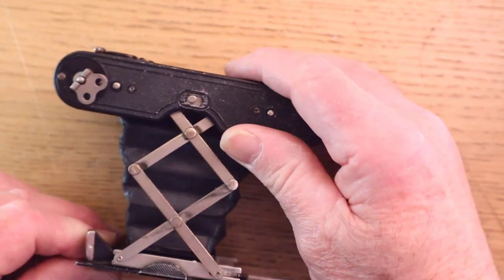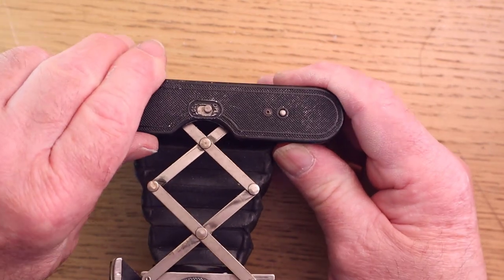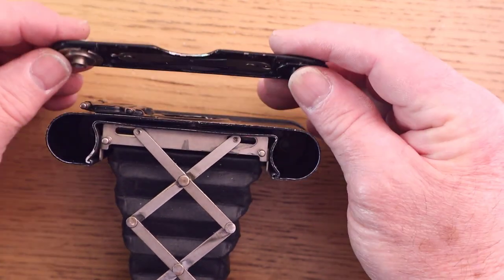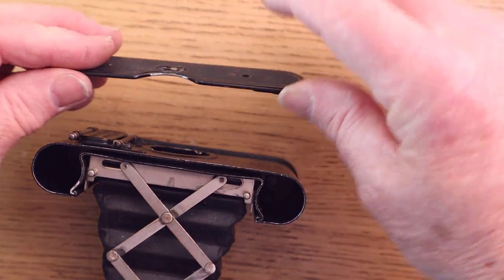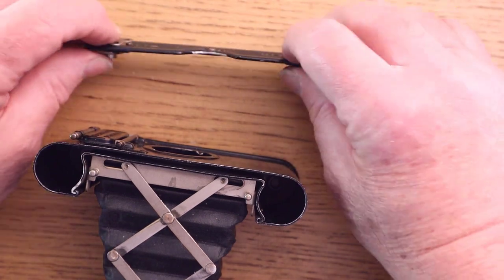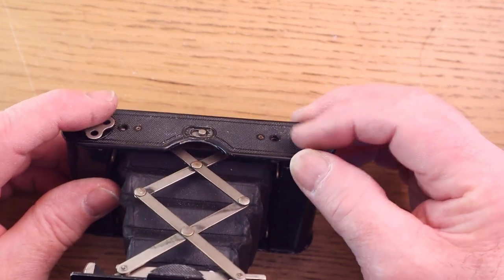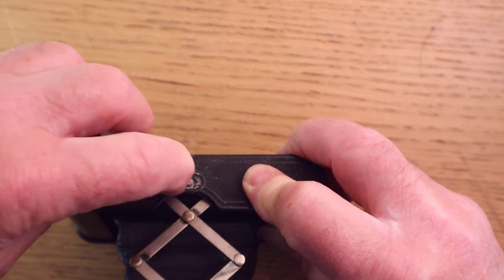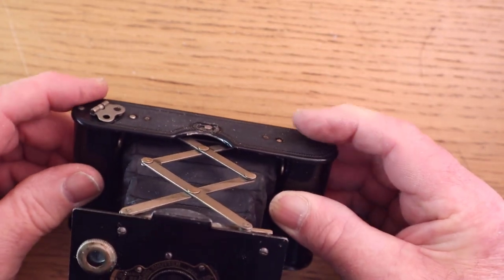And then the next thing, and the final thing, was the top plate on the camera. Now, some of you might do this, some might not, but I have done that. If you look at the top plate, make sure that it's not bending, arcing upwards that way. Look at it straight on like this, and if you can, just bend it very, very slightly so it's bowed slightly. And it means that when it goes on to there, once you put the film in and press the catch, it really tightens it down at left and right hand side, so you get a good seal.